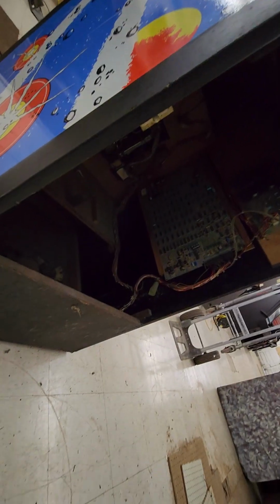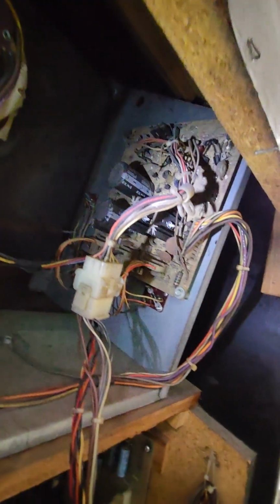Okay, there, I got the plug in. Now, let's pull the interlock out, and while we do that, we'll watch and see if that board, which looks pretty dirty, lights up on the deflection board. Okay, nothing, so let's try the power switch. Nothing. Oh, it's missing the main fuse there. Okay.